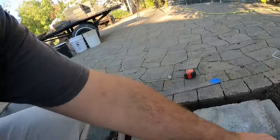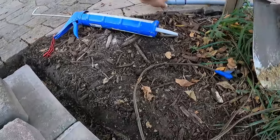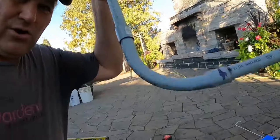On this one I chipped a little bit off to put in a piece of conduit for future landscape lighting. I'm going to cover that in another video. If you think you never ever are going to want landscape lighting, you're wrong — it's amazing. But even if you don't think you're going to do it, take the two seconds and three dollars to put a little 90-degree elbow in there so you'll have it for the future and don't have to dismantle the whole pillar later. Now I'm going to square it up and start stacking.